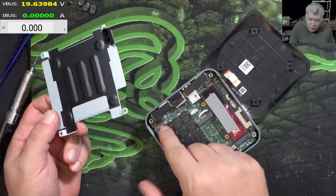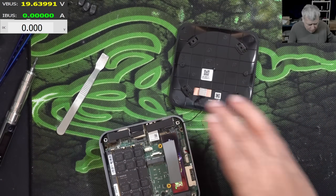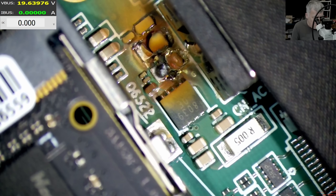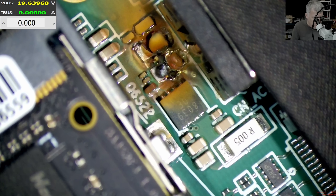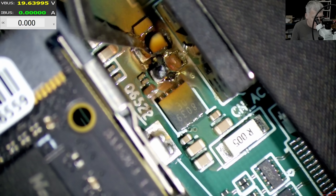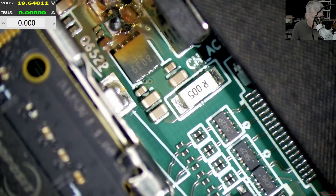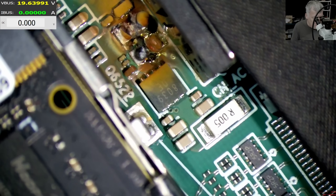Check there — let's look under the microscope. What is that damage? You know what components actually blew up there? Not a capacitor — actually inductors. But why would the inductors explode like this? Because there's no fuse? Yeah, probably.